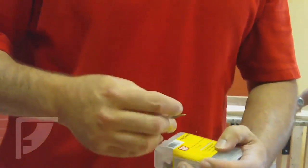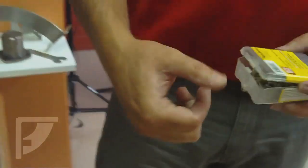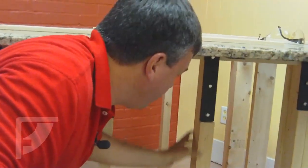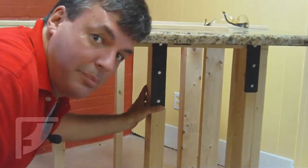Brock very professionally pre-cut our fur strips, so we're ready to put them on. No waiting. We're using some small paneling board nails to nail these on — nothing too substantial. If you're using a heavier fascia, like a stone or tile fascia, you might need to use a heavier nail to fasten your furring on. The fascia here is evened up with the bracket, so we're going to mark the outer edges, each side of the bracket. Then after we've done that, we'll take the board back up and draw in a quarter inch notch that we're going to put in there that'll fit around the bracket.